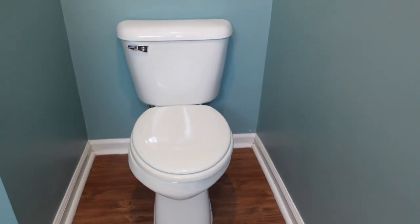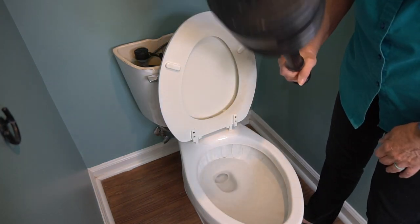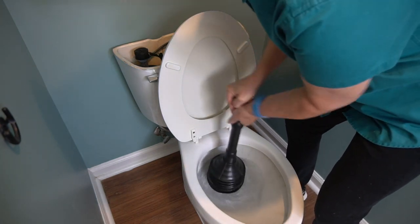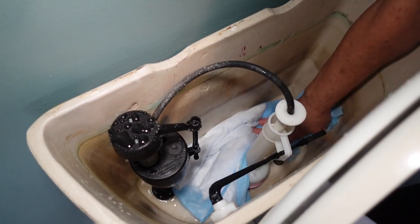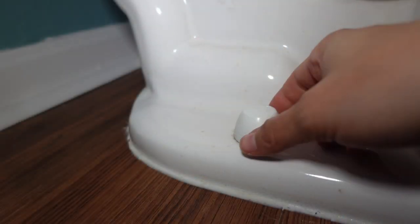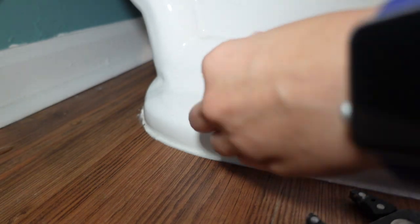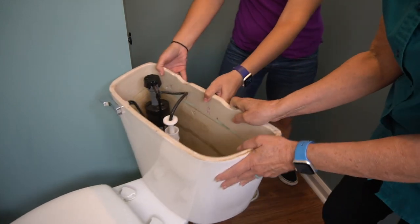This is the original toilet — you can see how it's leaking. We first removed the water from the old toilet, soaking up the excess with puppy pads, which are super absorbent and hold onto liquid without dripping. We removed the old water supply line, and the toilet itself was easy to remove by taking off the caps and removing the nuts and washers. We scored the caulk around the toilet and lifted it straight up, then put it on a furniture dolly to get it out of the bathroom.